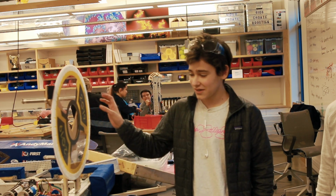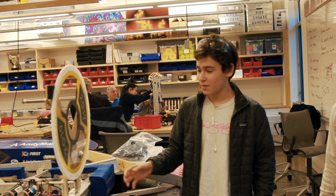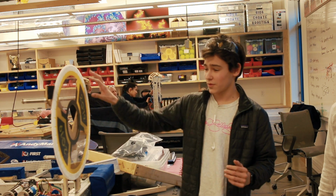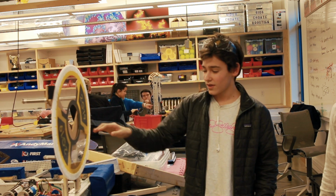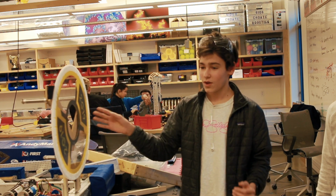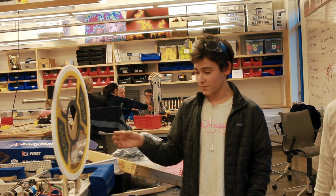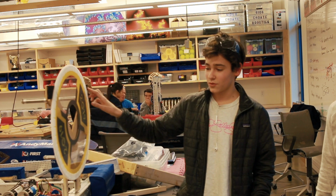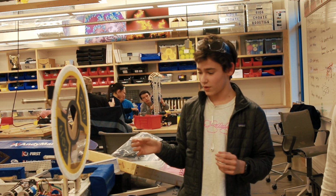So this is our hatch panel intake and extake mechanism. Basically how it works is we put 3 main pieces of Velcro onto a wood cutout to grasp the hatch panel when taking it off the brushes from the human loader and putting it back onto the cargo ship or the rocket ship. We put them in specific places to avoid contact with the brushes when getting the actual hatch panel from the human loader.